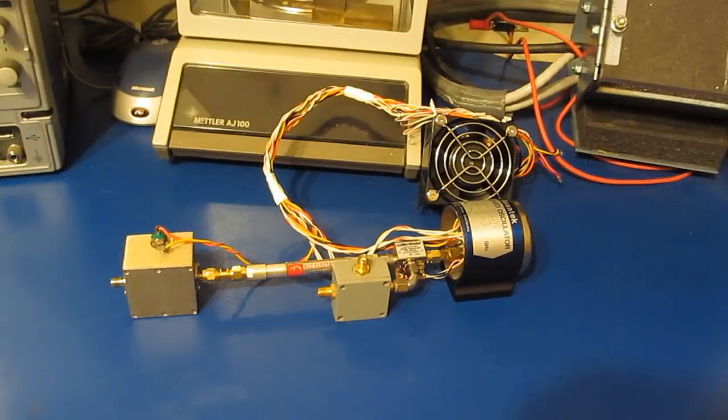The rules: no ICs, no crystals, MEMS, etc. No soldering except to add wire to SMT parts. All electrical connections between individual parts must be made by the breadboard contacts. The output signal shall be sine-ish and be able to drive a 10K load at least 5 volts peak to peak. Update, you may deviate from this rule within reason as we have arrived at microwaves. Self-made discrete parts are allowed and encouraged.